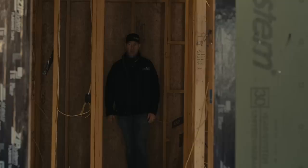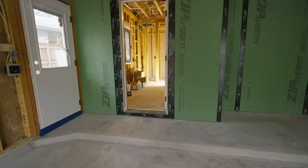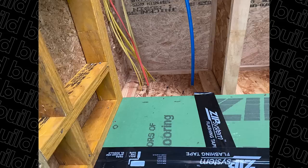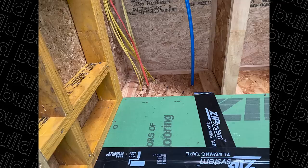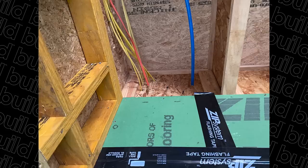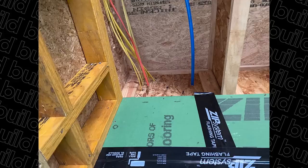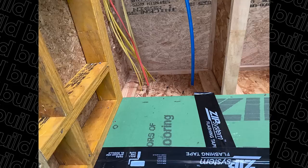Now let's go to another area of the house that's really common to see this problem. This is my pantry and then this is my laundry room space, and this doorway here separates my house from my garage space. This wall that separates the house from the garage stops right here where my floor joists are, and I've got some second floor joists and my kids' bedrooms above me. What I did was have my framer block that area with some OSB in between my floor joists. If I hadn't done that, the electrician and the plumber would be running wires and pipes through that space — it would be super hard to air seal that later. By putting that blocking, that piece of OSB in there now, I can then have the plumber and the electrician drill that, and again, one hole per one wire. You can see I've got each one of those in its individual hole, so now I can come back and air seal that.